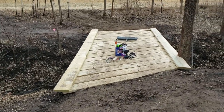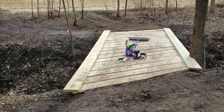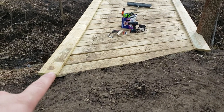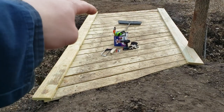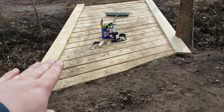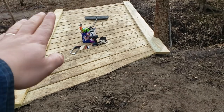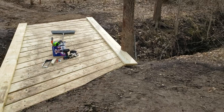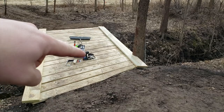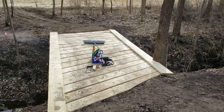It's a little challenging when you eyeball things because sometimes they're not exactly right, but I'll do my best. I'm going to pre-drill and start screwing these in, working my way from this end all the way down because that end is a high point — if I pull that down it's going to want to lift the whole board. Starting at the low end I can hopefully walk down to the low point and follow up to the high point. I'll stand on it while I drill to pull that section down. This side is quite a bit straighter because of the way this log was, so I think I'll have less trouble with it. That saddle looks really nice — I was happy with how it turned out.